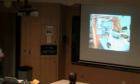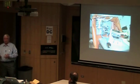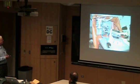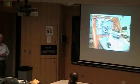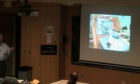This shows something we had to do. This is the grinding head that's going to grind this work. If that's not a good spherical or toroidal shape, you're going to know it because your part's going to be bad, because you transmit whatever the shape of the grinding error is onto the work. How do you avoid that? The shop told me they wanted to buy a new machine for dressing the grinding wheel. I said, nonsense. You put another spindle in our machine, it's going to give you a better result for less money. And after 6 months of begging, I got what I wanted, and they could generate the proper shape of that wheel against this other spindle whenever they needed to.